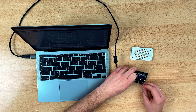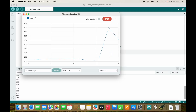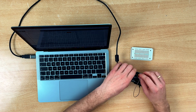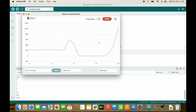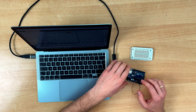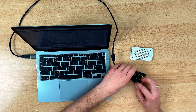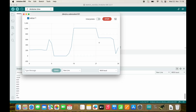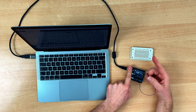If I connect analog zero to ground it will go straight to zero. If I connect it to 5 volts it will go straight up to 1023. We also have 3.3 volts which is somewhere in between. If we keep it floating it will do random stuff because it's not connected to anything, and if I touch it, it will change. If I touch ground and then touch the ADC pin I will act as a resistor to ground.